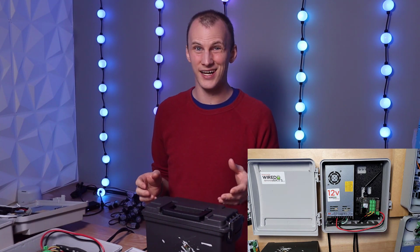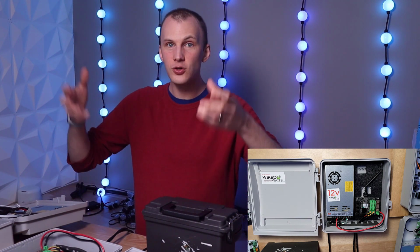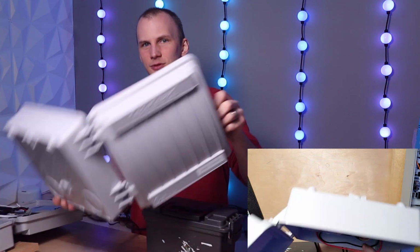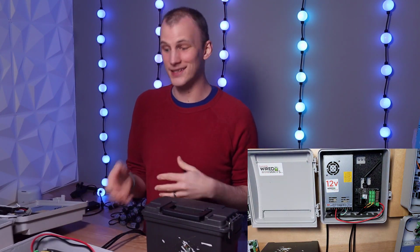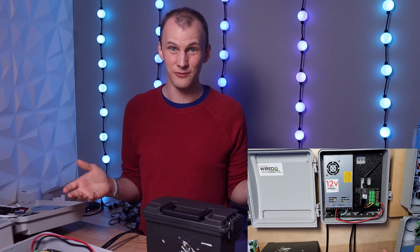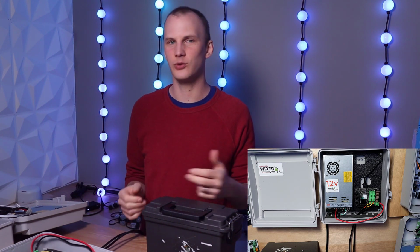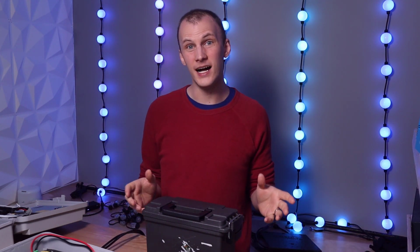And so that's the big caveat of the Cable Guard and why some people really dislike them, is you have to orient them vertically. The cables, they got to be coming out the bottom. If you lay it on the ground and the cables are coming out the side, just assume that a bunch of water is going to get in and fry your controller. It's not going to work, okay? The plastic's paintable, ready to rock. I like them a lot.